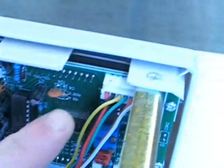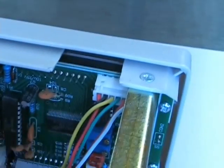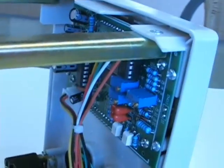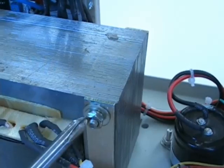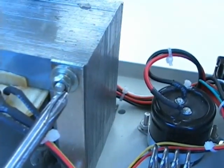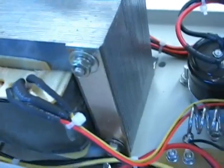They've actually used sockets here on the front board — that's rather surprising because it costs extra. They've gone for the more expensive 5 or 10 turn trim pots here rather than the cheap single turn ones. So they've gone to a bit of trouble, and there looks like a couple of opto couplers there, so they're doing the proper design. This board actually looks like it's designed fairly well — it's a Sarko brand, and Sarko are the ones who make this supply. As for the transformer, that's assembled properly. They've got proper shake-proof washers and shake-proof captive nuts in there — it's really quite good.